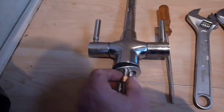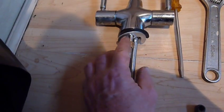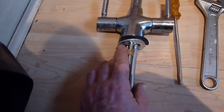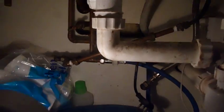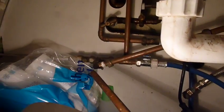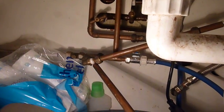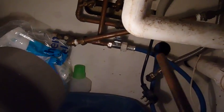This one has a screw — I think it's a 12mm bolt — so it goes back on like that. So far what I've done is isolated the water supply. This is one of the feeds here, so I've just taken my adjustable wrench and undid that end.